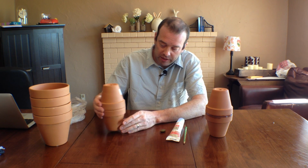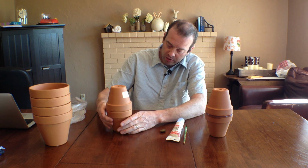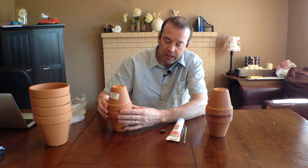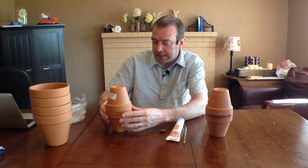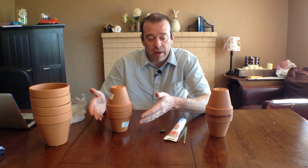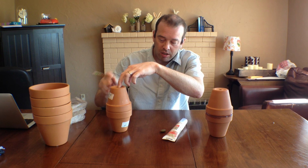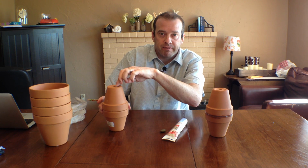And then once you get home, just put them together and look around. Sometimes you have to turn them or move them around to get them to a point where it really lines up and makes a good looking seal. So if you do have one that's really out of whack like that, and you find the perfect spot, just grab your pencil and throw a line on either side of the pot. That way, as soon as you get ready to silicone it, you can line those lines right back up and you know you're going to be good to go.